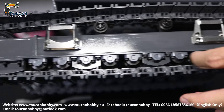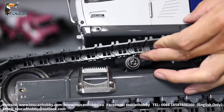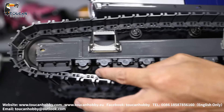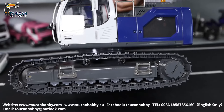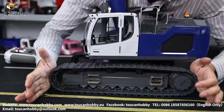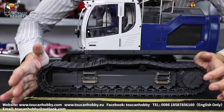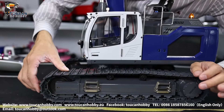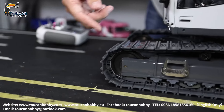It is there. And here the turn roller — this is the metal color, not painted. Also the return roller, yeah, also stainless steel, not painted. That's the metal color. And the tension for the track — we can push a little to see this one. There is tension inside with a spring. If it's too tight or too loose, inside this one you open the bridge and actually can adjust the screw tension.